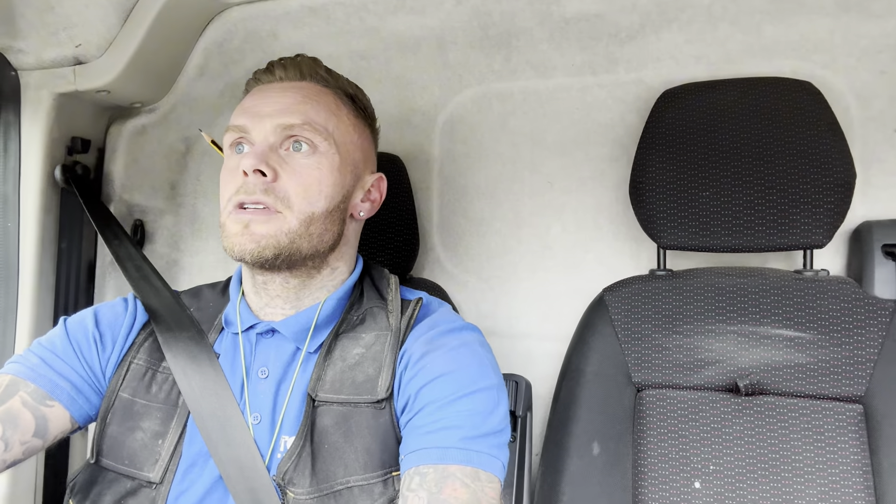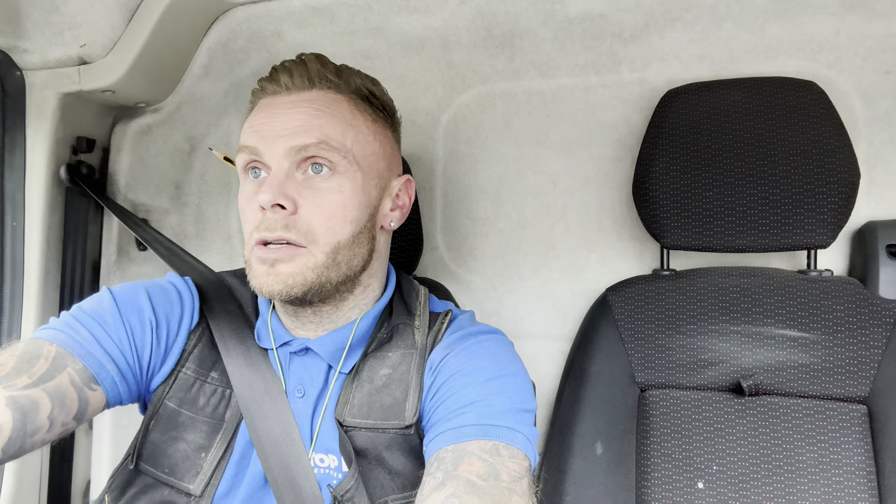Spray painting is not our main trade, it's a trade we do offer, and we've been doing it for probably six years. In my eyes, the main part of spray painting isn't actually the technique of spraying - it is your prep. I know people say that all the time, but it really is true. If you spend a lot of time on your prep work, get your coats flat in between, and use the right tips, it definitely helps. We've tried all different types of paint - we started off with water-based, we've tried pre-cat PU, we've tried a lot of them.